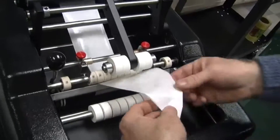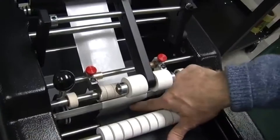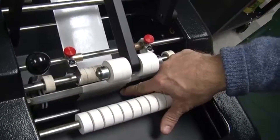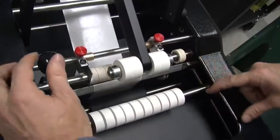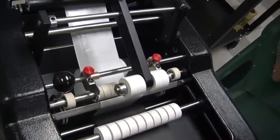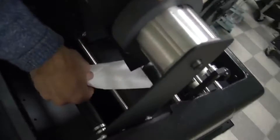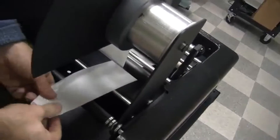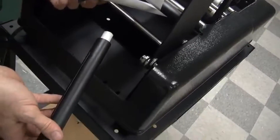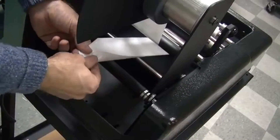Then I like to make a point, and I just insert the material — the vacuum material — between the 4-inch roller and the 8-inch pinch roller. You can see it automatically deflects towards the back of the machine. Feed out some material. We have a waste rewind, just like a roll of toilet paper, spring loaded.